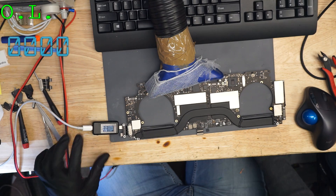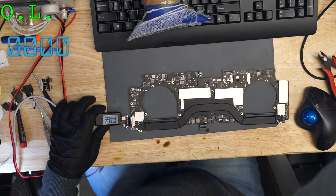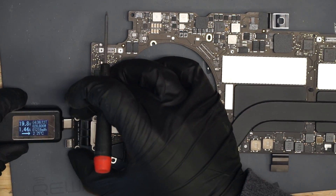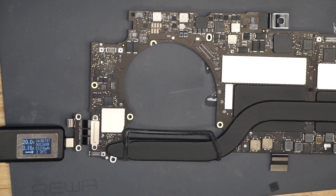Let's see if this works. The boot sequence is proper — using 20 milliamps on 5 volts, then 20 volts at 1.22 amps. See that? That's a proper-looking boot sequence. We fixed our problem. We had a short circuit to ground on the power rail required for powering the CD3215. That's the chip that talks to the charger and tells it to put out 20 volts instead of 5. We cleared our short circuit.